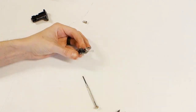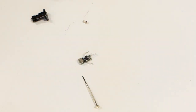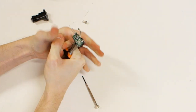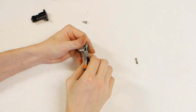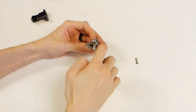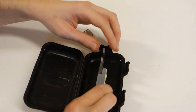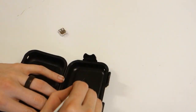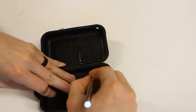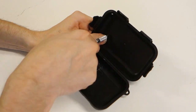You can cut off the spring and the wings to length — just leave enough to solder wires to. Then measure the components which will fit through the enclosure, i.e. the USB port and the on/off switch. Plan out where you want them and cut holes through the enclosure to fit them properly.